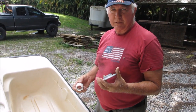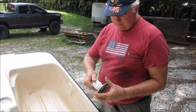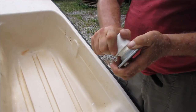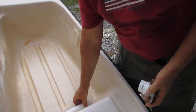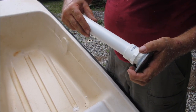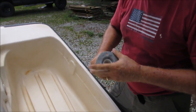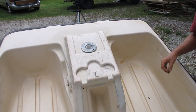Next we're going to adapt the steel galvanized floor plate to the PVC. We're going to put this threaded male fitting on here and get it as tight as we can. Then we're going to put a piece - I've already measured it so this is already the right length for the shaft - and that's going to fit on here, then we're going to put it down through the hole.